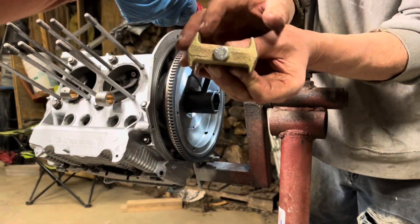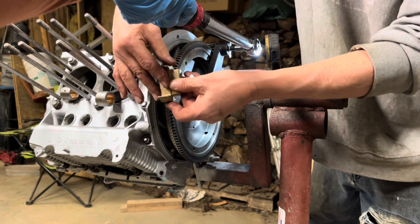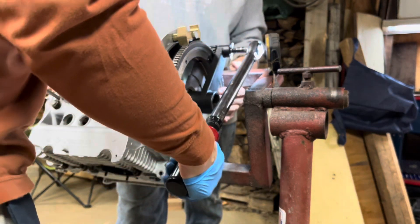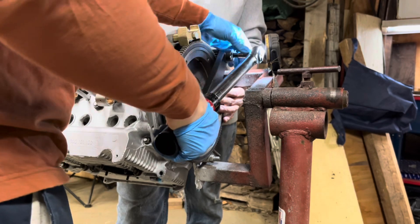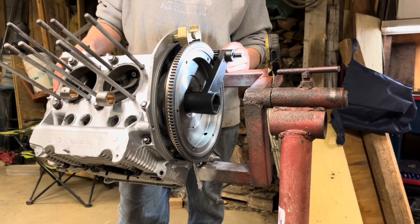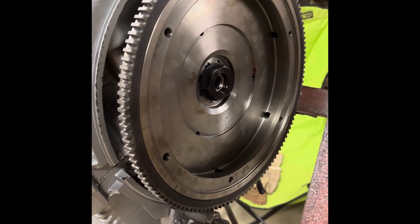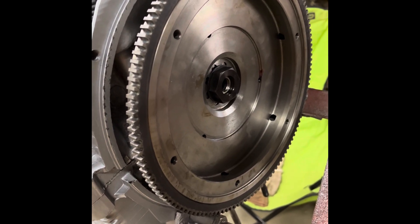The flywheel lock has two sides: one side fits the teeth of a six-volt flywheel, the other fits the teeth of a 12-volt flywheel. It just sits in there — hand tight is good enough, that'll hold it. And there we are — we just torqued our gland nut to 270 foot-pounds. That easy. We're going to leave off at this point. When we come back, we'll continue installing the rings and the pistons and moving forward with assembling the long block. Thank you for watching.